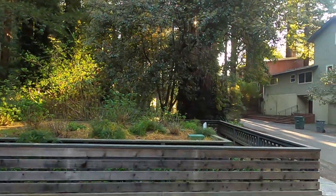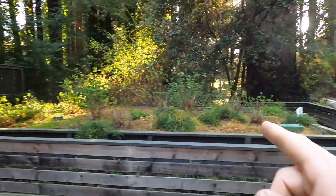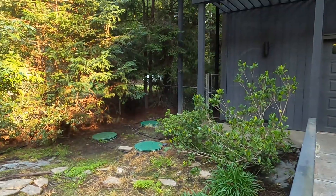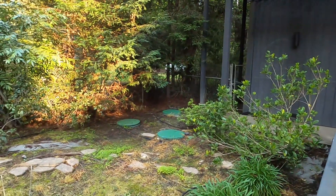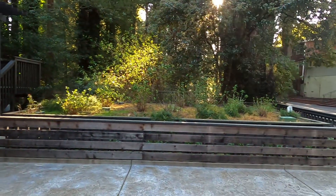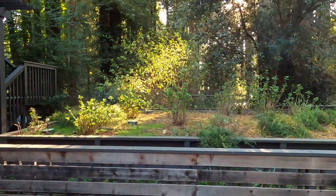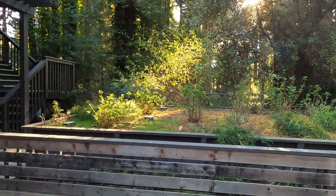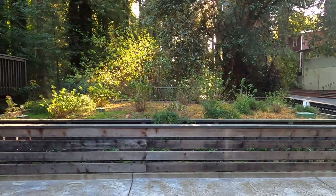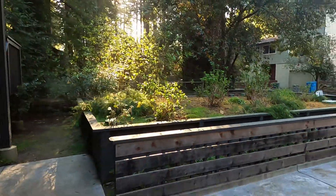It's a beautiful morning amongst the redwoods and today I'm going to be purging this sand filter. The tanks are right over here. First thing I like to do is open up the septic tank and sump tank, pull the effluent filter, and get that rinsed out. Then I'll open up the boxes and prepare for the purge. I'll give you some tips on purging whether it's a sand filter, pressure distribution system, mound system, at-grade — anything that has a pump pressurizing laterals.